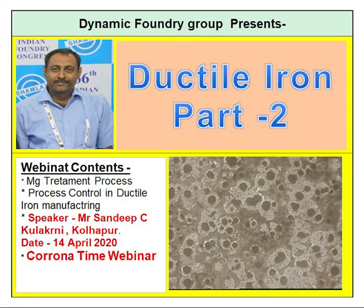Next slide, there is alloy sizing. Size of alloy, as I told you, 5 to 15 or 5 to 20 are the two more popular sizes. Storage of foundry alloy is again important to avoid the oxidation of magnesium alloy. You have to store it in proper sealed containers, or in sealed bags.